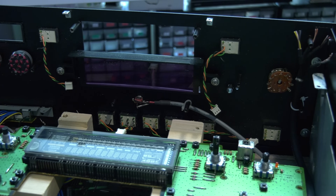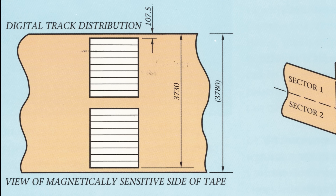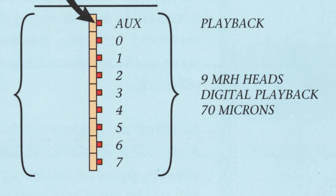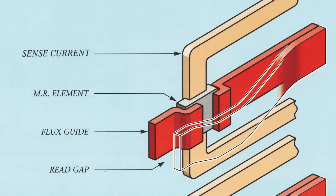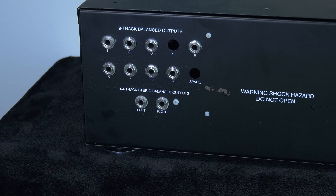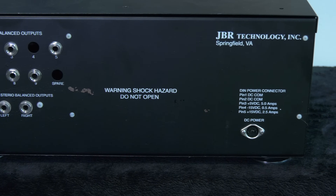Several phone interviews were conducted over a three-year period with James, as health and COVID issues prevented us from meeting him. Hopefully an interview on camera will be possible in the future. When James read about the Philips DCC technology and the magnetoresistive heads, he immediately realized that this would be usable in audio forensics. Magnetoresistive heads are able to read regular analog tape at 60 decibel versus normally 20 decibel. By modifying an existing Philips DCC 900 with 11 unique outputs directly from the read-write board to a custom-built amplifier, analog tapes that had very weak signal were able to be made audible again.